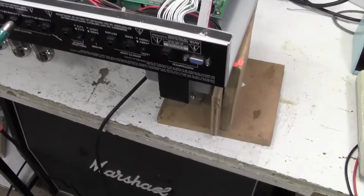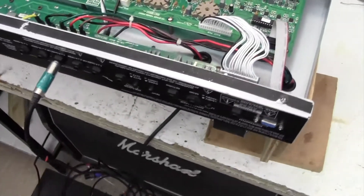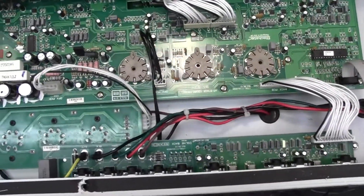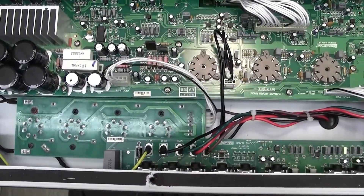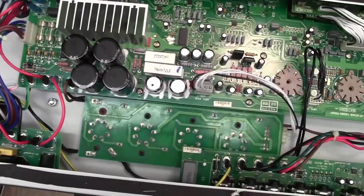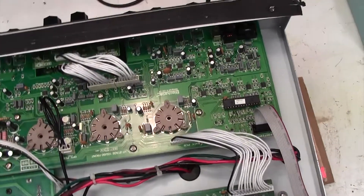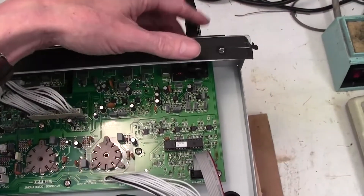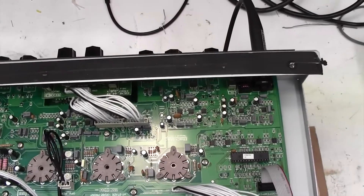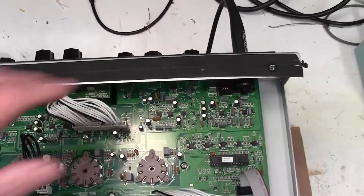I've got the amp flipped over on my handy little stands here which support both sides of the amp. As you can see these are all or mostly surface mount components so there is not a lot of maintenance that you can do on these amplifiers. Before we get started on the bias I want to point out a little catch-22: nothing will happen on this amplifier until you have an input jack plugged in. This amplifier has a circuit which kills all the output tube current until the jack is plugged in, so if you try and bias this without that jack plugged in you'll struggle.